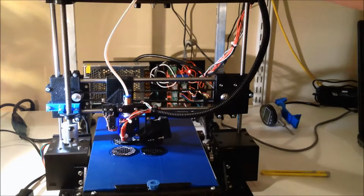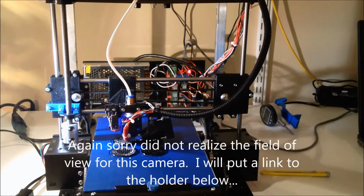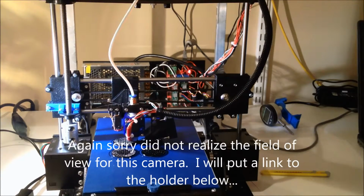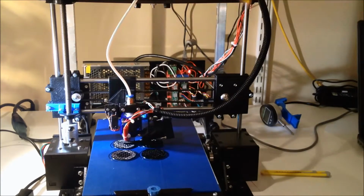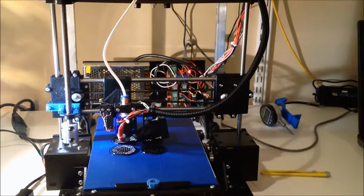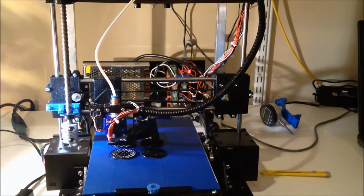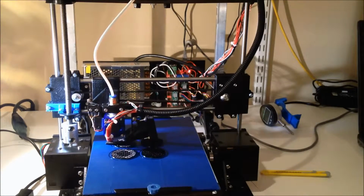There's a skate bearing inside here, and this mounts up here. There's an internal piece that mounts to the rod, and I warmed it up so it basically screws on there, so it's very tight. This now pins it in three spots, so it is far more rigid than it was before. I've been very happy with this, and actually in the up motion there's very little Z skipping, or where it jumps, because it doesn't have two motors. So again, I've been very happy with those modifications.